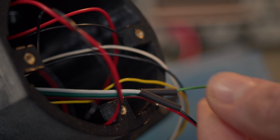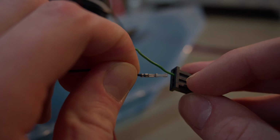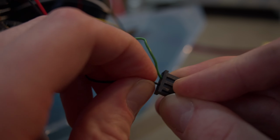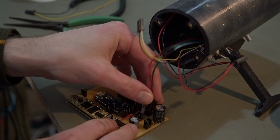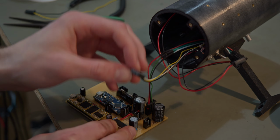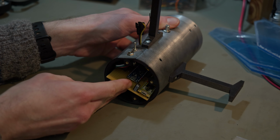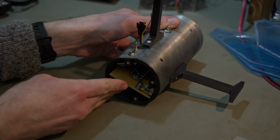The LED matrix came with both input and output data connectors for cascading, and I didn't need the output, so I'm using the female connector to connect the input to the motherboard. The motherboard also contains the two microcontrollers and the amplifier. I'm also using connectors for things like the volume knob, power switch, and speaker so that it's easier to remove in case I need to change something in the future.